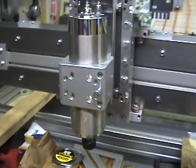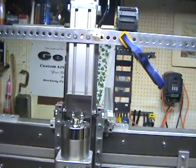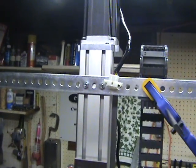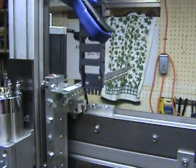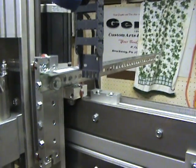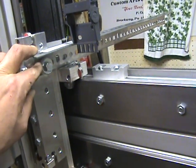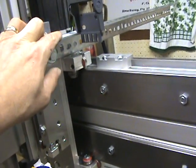If you've gotten one of these spindle mounts and you have this hole but don't have a bolt, what you could temporarily do is the 5/16ths bolts here are one inch long — just long enough to give you some spread to get this in and out. I actually went out and bought an inch and a half. Now I'm working on figuring out where I'm going to put all my E-chains. I've got some steel strapping material here with holes in it, both some flat pieces and some angular ones. I'm just kind of lining things up. You do have some threads in this hole — you'll need a shorter bolt. I've just got a bunch of washers in there right now to hold it in place, but it will allow it to lie fairly flat on here.